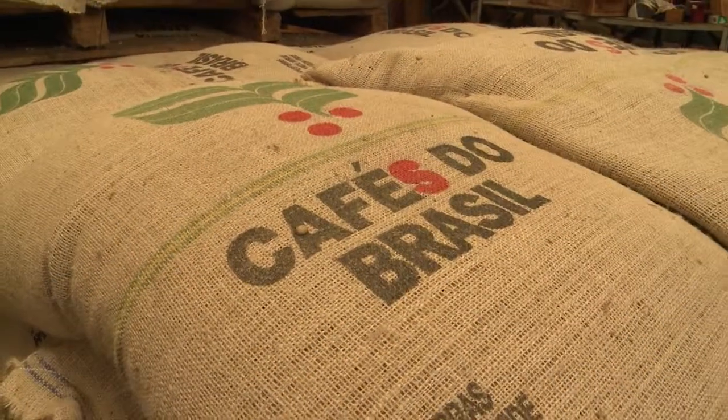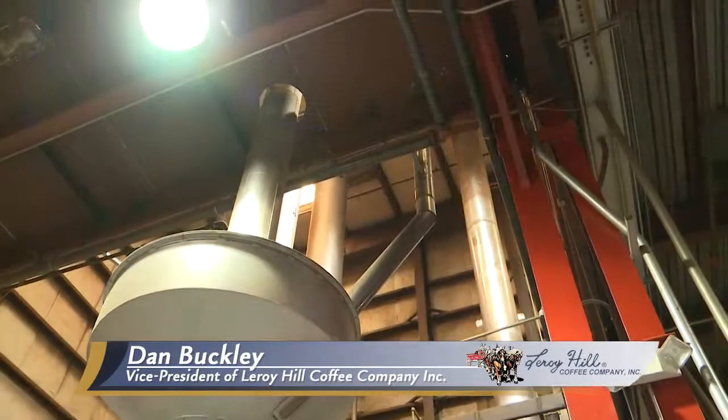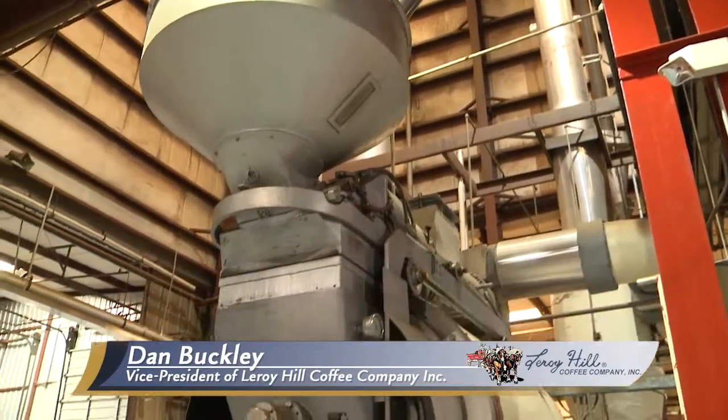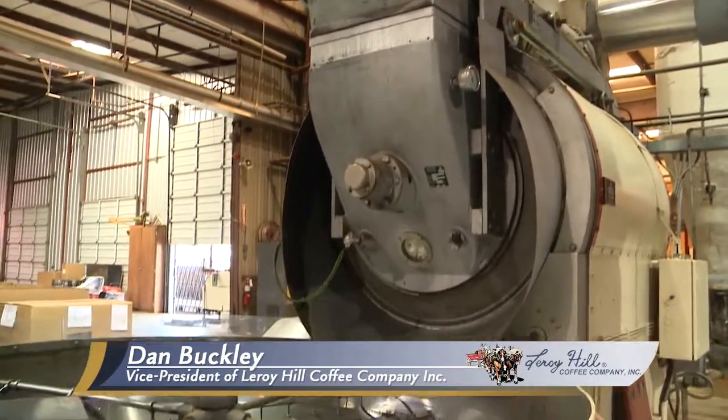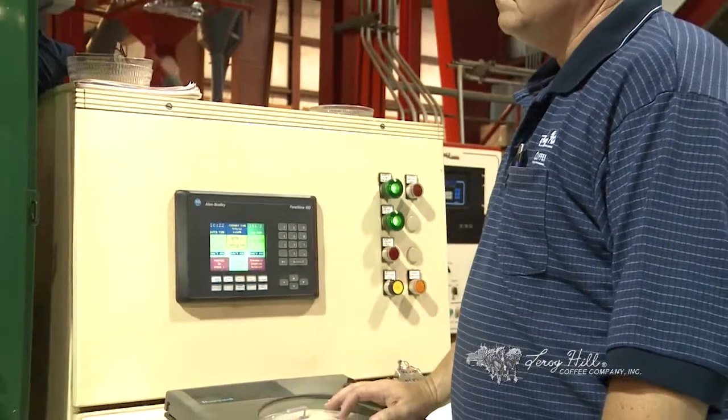When we got into roasting ourselves in 1983, we found that there's a 16% shrink in the cooking process, so when you roast 600 pounds, you get 504 back. But we'll roast it up and get our 504 pounds, and when we finish roasting coffee, we quench the roast with some water. That's just to guarantee that the roasting process stops when we want it to, so it guarantees us what the color is.